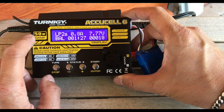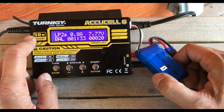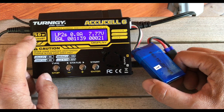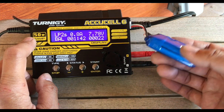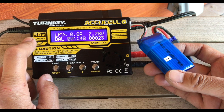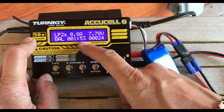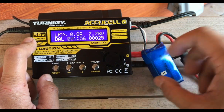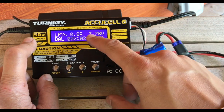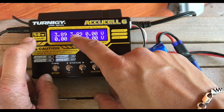When I first started and saw 4.2 volts, I was alarmed because I knew overcharging a battery can be really dangerous. But that was before I realized 3.7 is nominal, and all 3.7V batteries will charge to 4.2. Since it's a two-cell battery and the actual full voltage is 4.2 per cell, it'll finish charging at 8.4 volts. Here we can see the time elapsed, how many milliamp hours have been added, and the total voltage of this two-cell battery — currently 7.78 volts. Click the button again to see each cell's individual voltage.